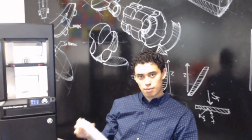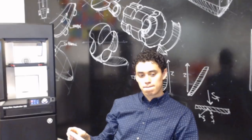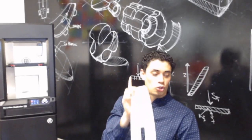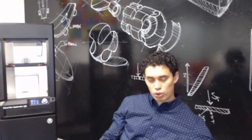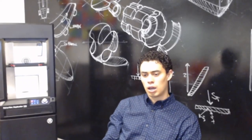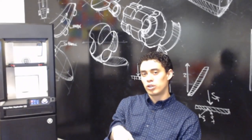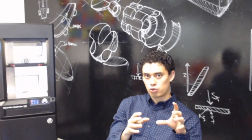Can regular material be printed from the tough extruder or vice versa? Yes, but not vice versa. You can print regular material in the tough extruder. Actually, it prints no problem. You do need to slice it for the tough extruder, and the printer will ask you to do that.